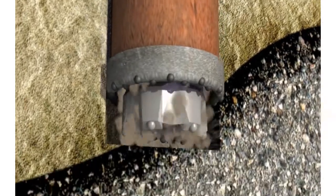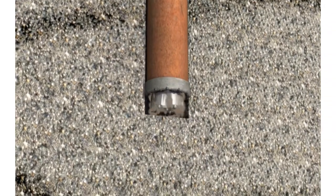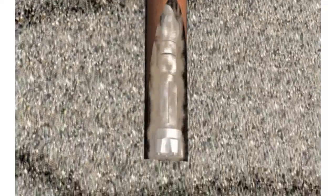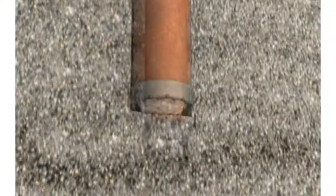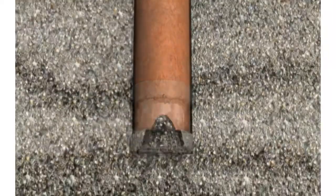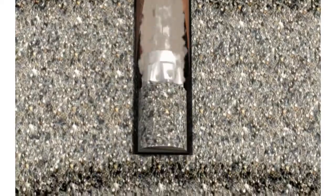The independent hydraulic top drive simultaneously handles a drill string equipped with a down-the-hole hammer, drag bit, or tricone bit. The upper and lower drives operate independently, which means the bit position can vary relative to the casing bottom. In normal drilling, the bit is advanced flush with or slightly ahead of the casing shoe for best penetration rates.